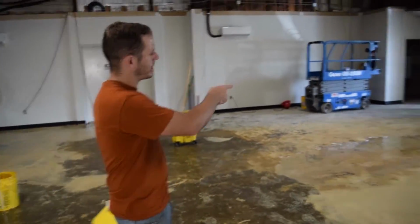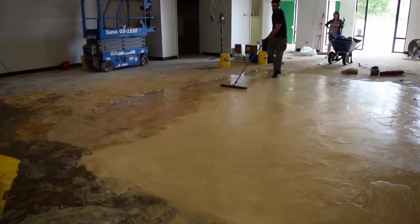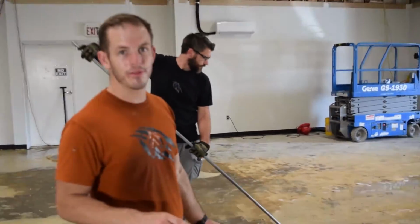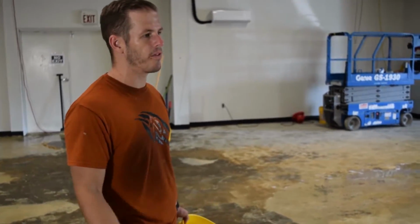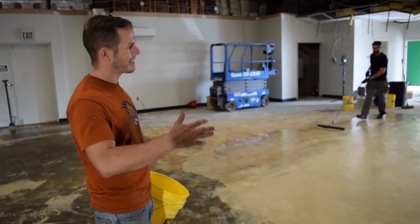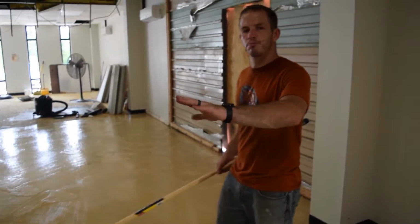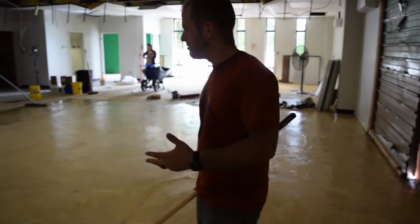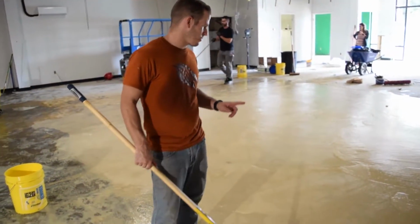Okay, so first of all, Johnny is over here spreading it. First, that's easy enough. You're just gonna dump it out, try to spread it evenly around. Now, do not be stingy with this stuff. A little bit of it, you might as well not have it on there. You need to flood the whole area and have it sitting on the surface. And for the first half hour, 45 minutes, you need to periodically go back with something like this brush here or a squeegee and just kind of spread it back out. Try to keep it evenly on the surface so it's soaking in. You don't have to do it the whole time, but just sort of every 10 minutes go back and kind of spread it out.